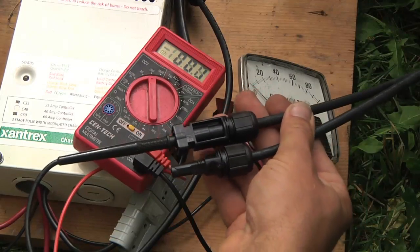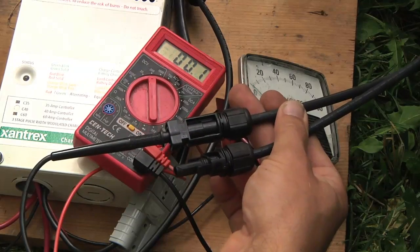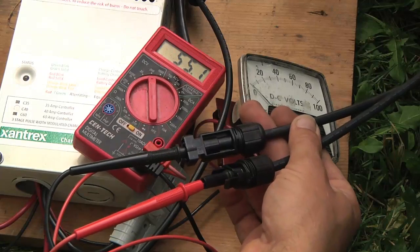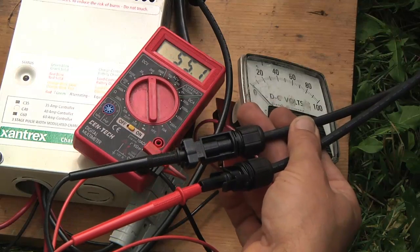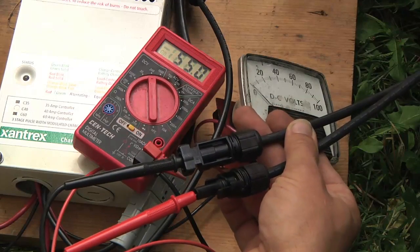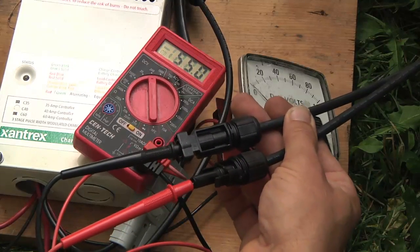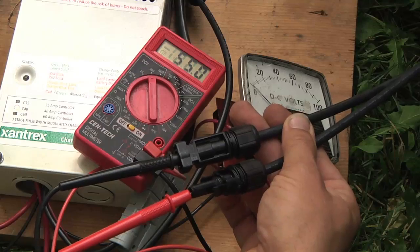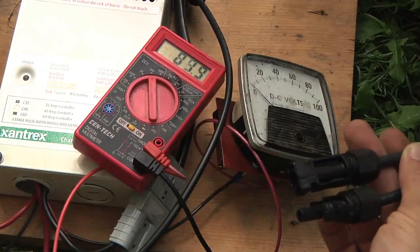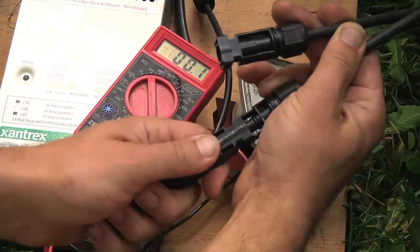I'm back behind the solar panel now. Here are the two ends from the solar panel — keep in mind if there's light shining on them, they're doing something. So if I hook this up, it's reading 55 volts, and when I tested it for current it was giving me about two amps, which is considerably less than this panel can produce. But it's really overcast right now — still that's a little over 100 watts on a very cloudy day.